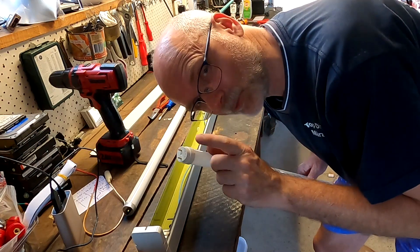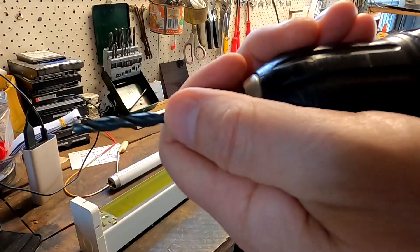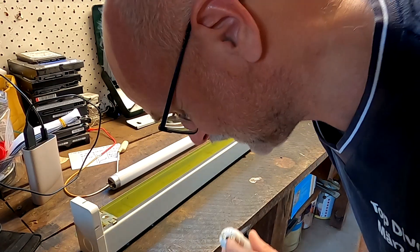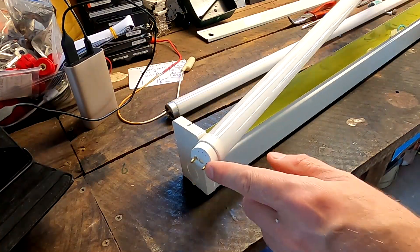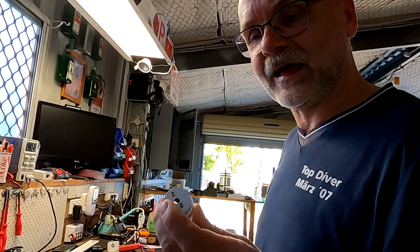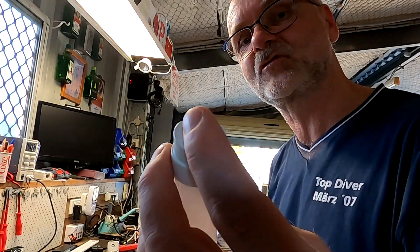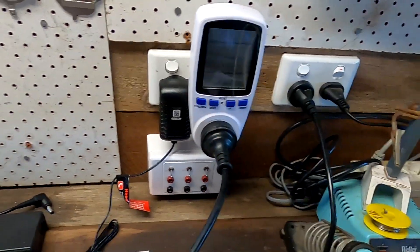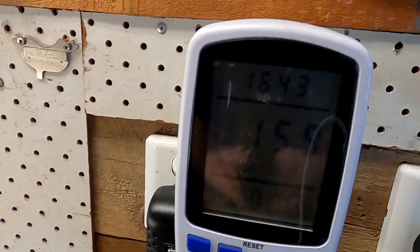To prevent a short circuit we're going to make a small modification to the actual light tube. I drilled a hole in the dead end — and I think we've already fixed it. I can see the wire inside is broken by the drill bit, so there's no continuity between those two pins anymore. Now if the tube is inserted the wrong way around, nothing will happen because that internal connection is gone. It will only work in one direction. And it works again.